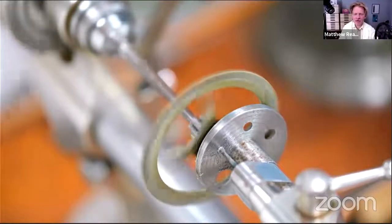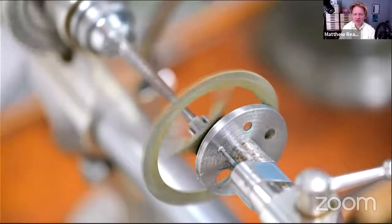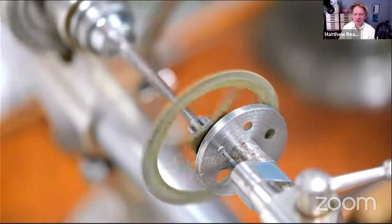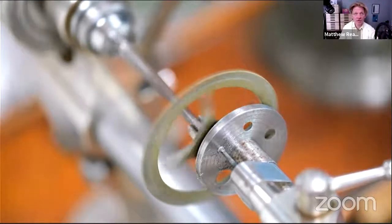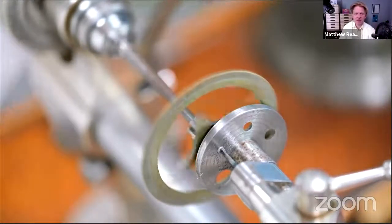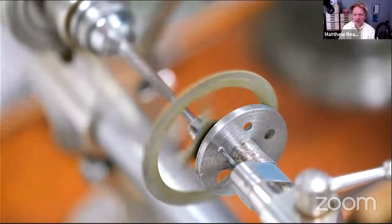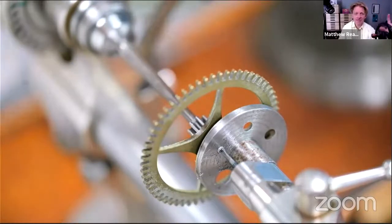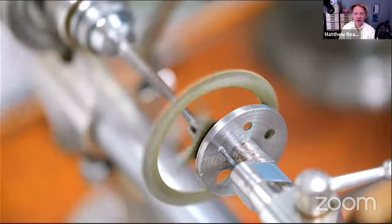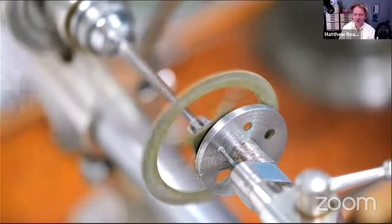Now, we were really lucky last week, I think, with this carbide drilled nice and deep, which is good. I did one repivoting during the week at 0.5 millimeters. So not tiny by sort of watch standards, but, you know, French clock thing. And of course, the key to it is getting the drill deep enough, because then you have got a lot better chance of the pivot not dropping out.